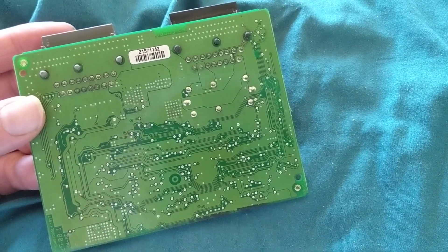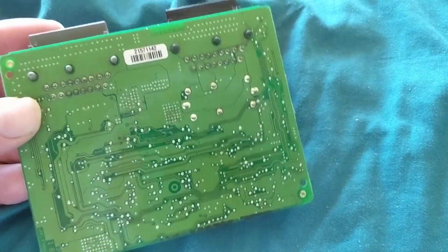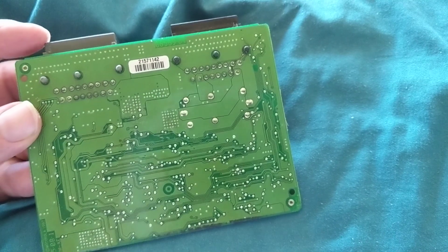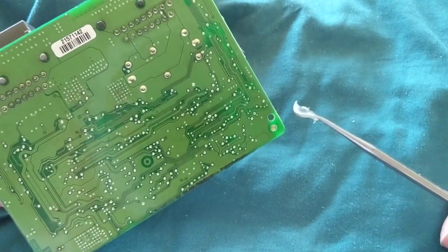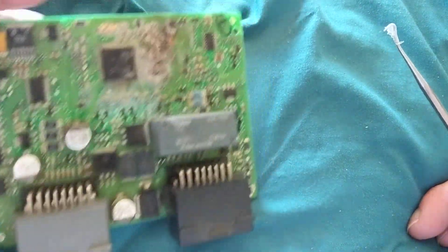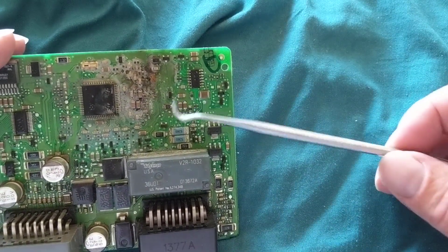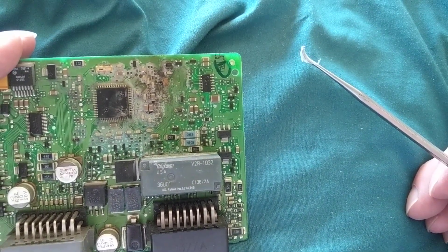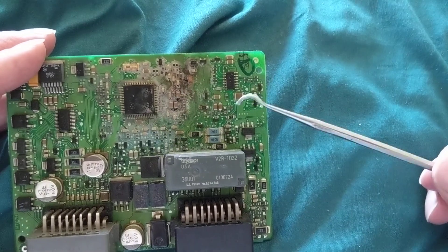The metal was not sealed properly because it was missing screws. I've spoken about modules on my channel before - Joe Electronics Schematics for Auto - about modules and surface mount technology components. I think this is the best proof and testimony of what I've been talking about. When you turn the board over you can see the result - a big burn, probably from water seeping in. This is not oxidation; this is the result of it not being closed properly.